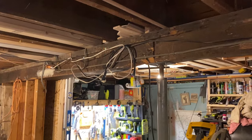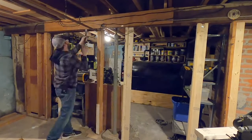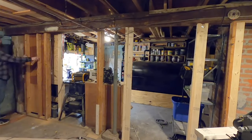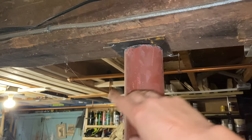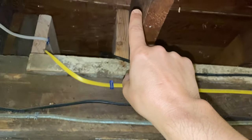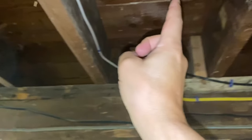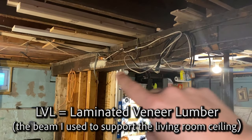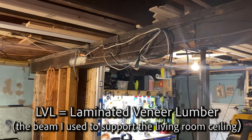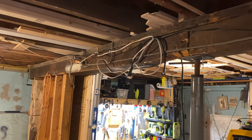When I did the living room dining room remodel, I actually ended up lowering this beam because they had jacked it up really high. This is the post that supports the load-carrying post that goes to the LVL up there, and that goes all the way to the end. Eventually I might actually do an LVL here, but the difference in cost is kind of a lot and a lot more work.